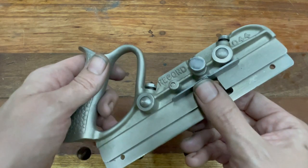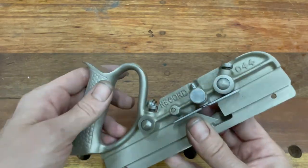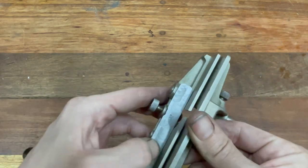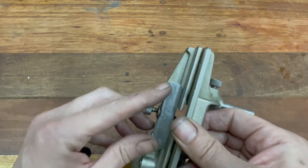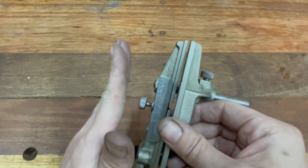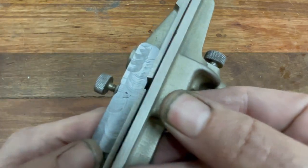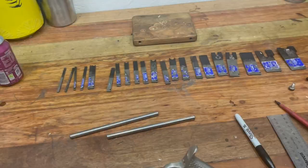It was a wee bit of work to get there, but I got it done in the end. The lathe with the end mill made mincemeat of that. It took it off, nae bother. When I took a cut for the bottom, I then had to reposition the tool holder by lifting it up, to get that perfect again. But it's flat enough, so that will do.